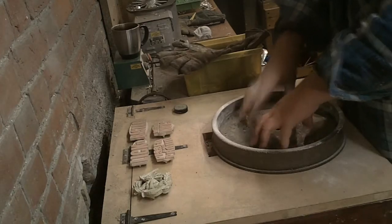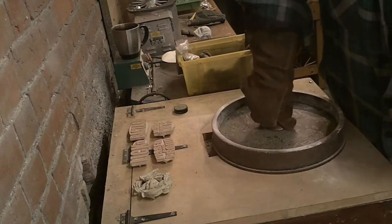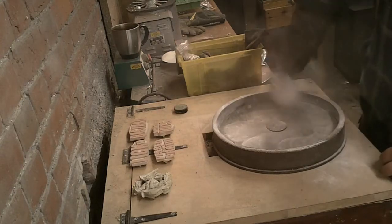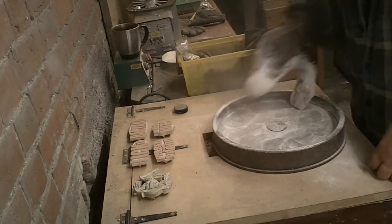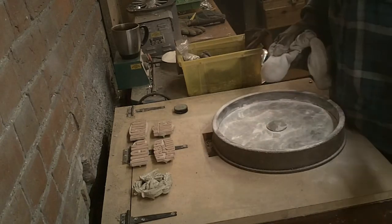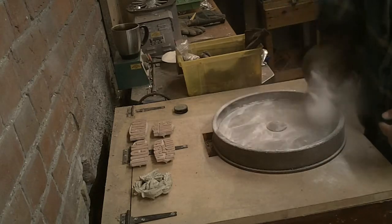Make sure that's sat nicely. Put the centre core in and dust again. Make sure you get right up to the edges. The purpose of the talc is two-fold: it stops the next part of the rubber sticking to the first, so you've got the two halves of the mould. And it also, when you put the pressure on — because these moulds are vulcanised with heat and pressure and everything's squashed down — allows air to escape. You don't want air trapped within the mould.